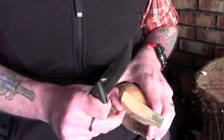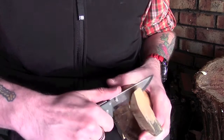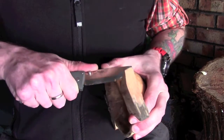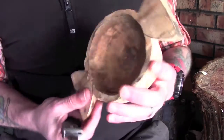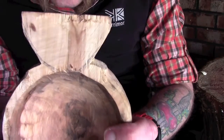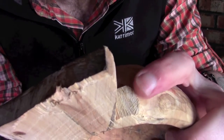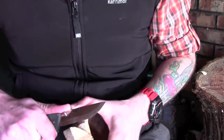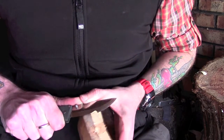All this could be tidied up a little bit just before we go to final sanding, probably in the next episode. So there we go — taking not very long at all. In comparison to the other side which I haven't touched yet, you can see we've still got two fairly large knobbly bits on the top here, and you can see where all of those knife cuts have come down. That's deliberate — we want to use that little piece of excess wood just to protect the bowl while we're putting these handles in.